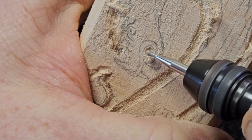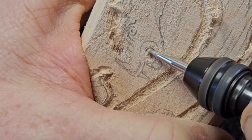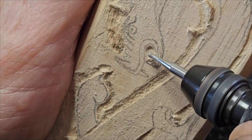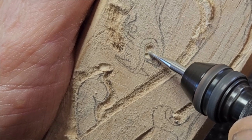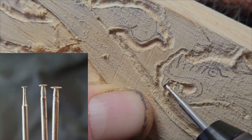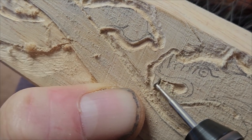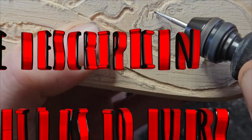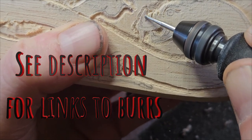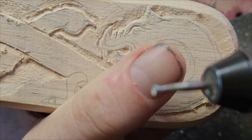One of the bits I like for these small details is the Dremel wheel point bit. It's a little bit smaller than the two millimetres it says, but it's really nice — it takes off just a little bit by going really lightly. You can see there's no build-up of fluffy wood bits, and this is a nice little bit to get those really sharp lines like the teeth. You can use the top of it as well — it's a diamond bit, sort of like a sanding disc. It's an inverted cone bit that I'm using there just to get a little bit of width in those nasal parts.